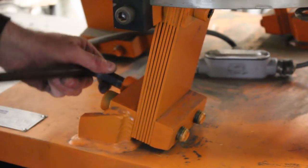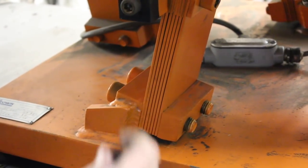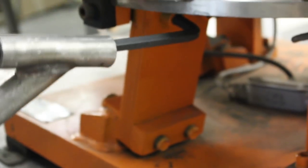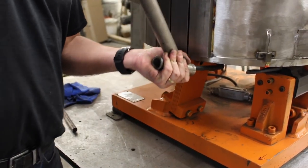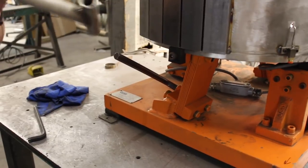Okay so we're running now — you're going to hear me start to crank this down. You're going to hear it start to take off. Here it comes. You can hear the power starting to come back in the unit — all I'm doing is cranking these springs down. Get the cheater bar back on that unit and get them tight. You can hear that unit getting faster and faster. It's under tuned, and the reason we know it's under tuned is because as we crank it down it's speeding up. This unit right now is real close to where I'd want to put it back in the field.